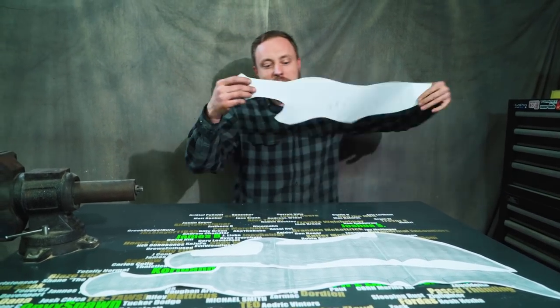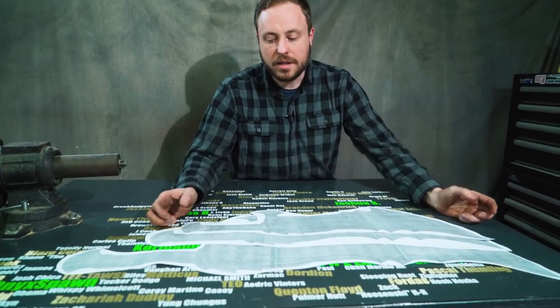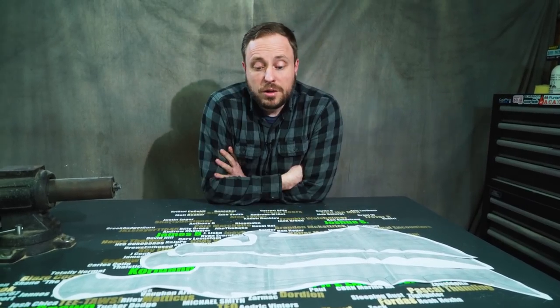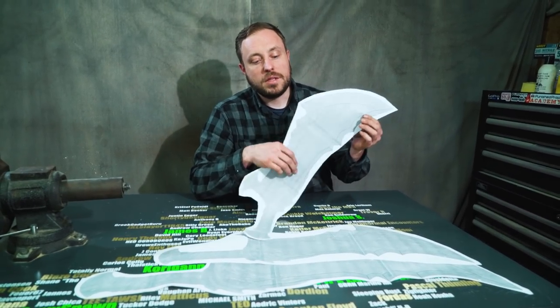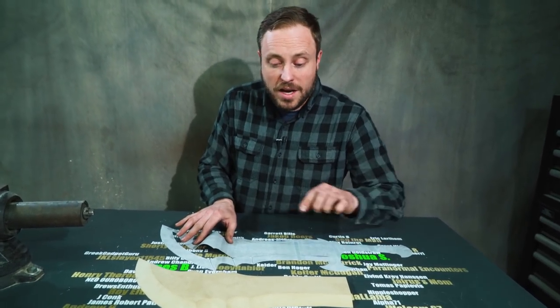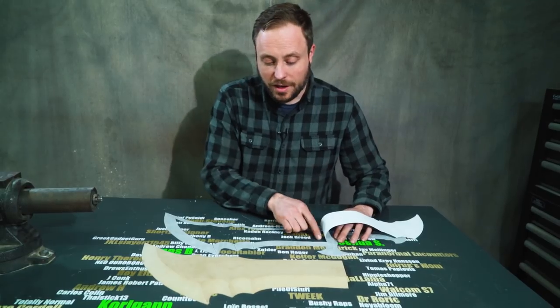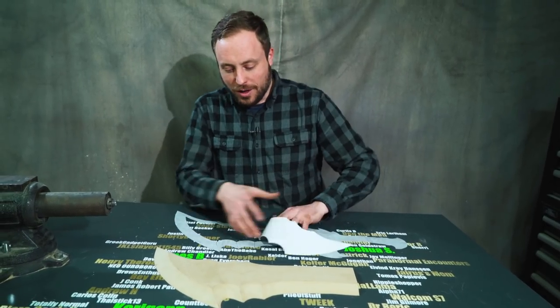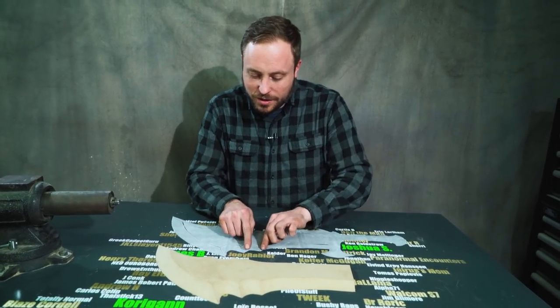And this is the blade scaled to my height at 5-foot-10, which is a little more reasonable, but it's still about an inch thick. I think it was 1.066 inches thick, which means it would probably weigh around 30 to 40 pounds. But I can't just build the sword from this template — I need to make another template from this template. I copied the outside of the sword template onto MDF, cut out the middle section, copied that lined up with the outside template, and then looked at the curvature of the transitions between the blade sections and copied those onto the MDF.